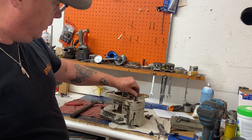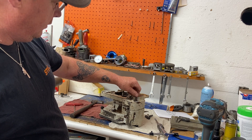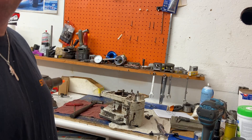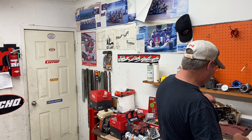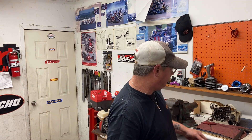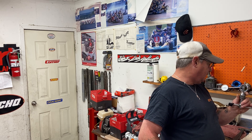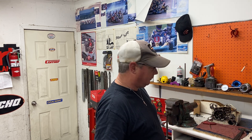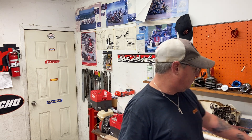Let's check it with a 5mm screw. There you go — threads in perfect. What did that take? A couple of minutes. That's a life saver. Those will work for any 5mm screw. So yeah, that's a pretty good fix — you can't beat it. I've told people before about these, but now I've noticed you can Google '5mm Keen-serts' and order them right off Amazon. Then just go to your local tool store and get the tap — an 8mm by 1.25 and a 17/64 drill. Works perfect. That's the 066 fix, which also applies to many other chainsaw models and any equipment with a 5mm bolt — go-kart engines, bicycles, you name it.